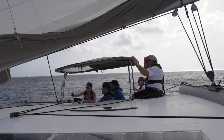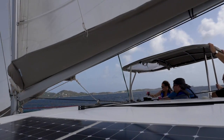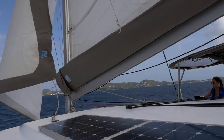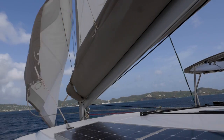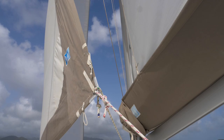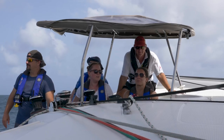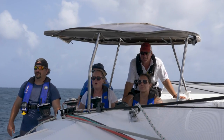The fin keel on a monohull acts as a pivot point, which the boat rotates around as it tacks. The catamaran we are sailing has longer shoal draft keels, which help the boat to track upwind, but do not provide a good pivot point for the boat when tacking. Where a monohull carves its turn through the wind, most catamarans slide through the tack, slowing the boat even more.